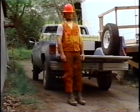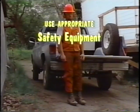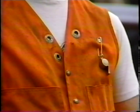Even the most experienced sawyer will be unprepared without the proper safety equipment. Remember to protect yourself from saw cuts with chaps, from debris with a regulation hardhat. Calked boots will help keep your footing firm, and don't forget to wear your eye and ear protection. A whistle will help you notify your buddies of an emergency situation or personal injury.